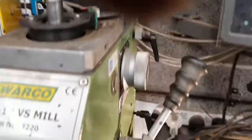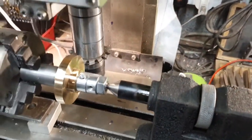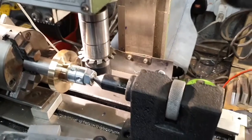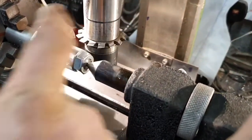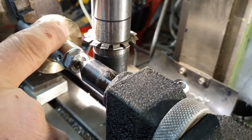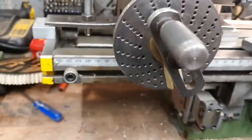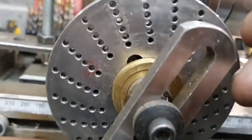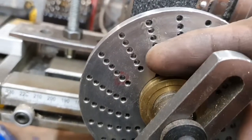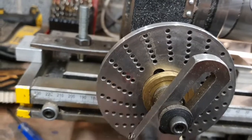I'm going to bring it forward until it touches, then zero it out and bring it in 2.16mm — that's the tooth depth. So I'll zero that out and bring it in 2.16mm. We've now pulled the cutter forward of the face 2.16mm, which is the depth of the cut. We're on the dividing head number 16, because we want one full turn and 14 sixteenths.